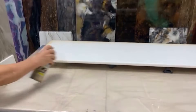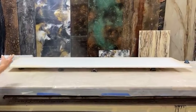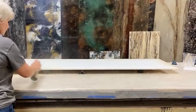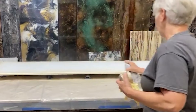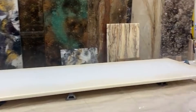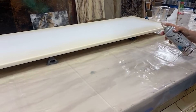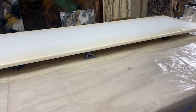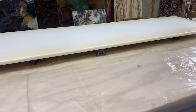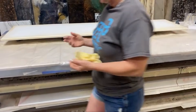That's why I'm fogging the edges — so when it does roll over, I'm seeing this color, not white. And this is how we get away with only having two colors of the undercoat, white and black. That way, I don't have to stock every single color of base coat for every finish that I do.